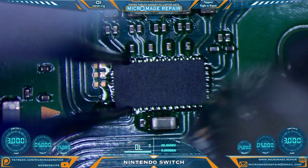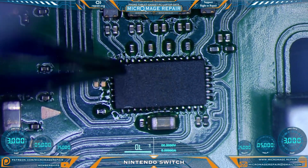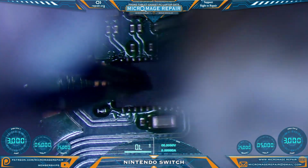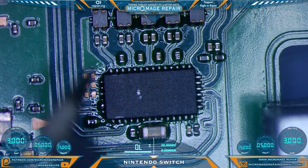So we need to grab the chip. Do not let go of the chip until you're sure that it has grabbed. Remove the air, let it tack down. Then apply some downward pressure, not too much. Re-wet and push it flat. Clean up your mess. Test again.